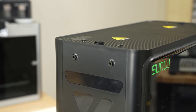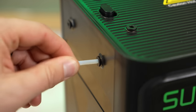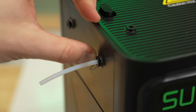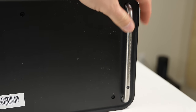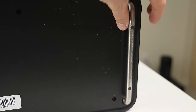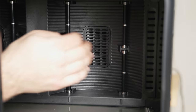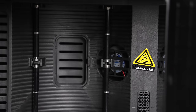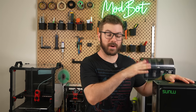For anyone wanting to feed filament directly from the dryer into the printer, there are a total of eight exit ports. The S4 comes with two long PTFE tubes and a handful of shorter ones, but if you needed more, you could easily source them. The dryer sits on two long feet that initially gave me some concern about the unit potentially tipping over, but thanks to the grippy parts on them and the weight of the unit — especially combined with the filament — it's pretty secure. Inside the dryer, there are four sets of spool stands that rotate freely on bearings. There are also two compartments for adding desiccant, though I don't really see the appeal unless you plan on storing filament in here when you're not actively running the dryer.